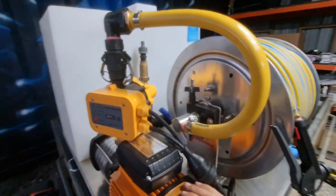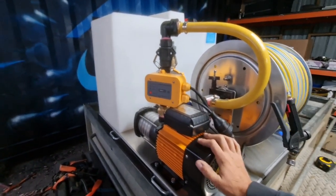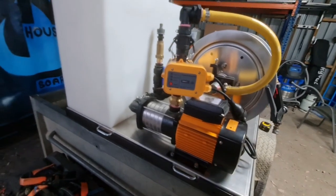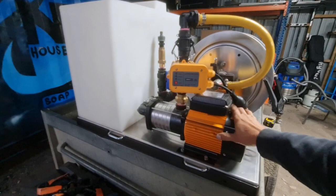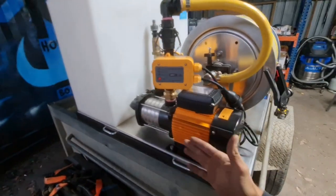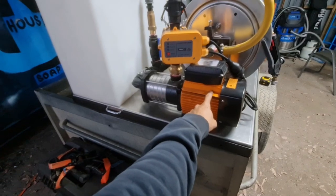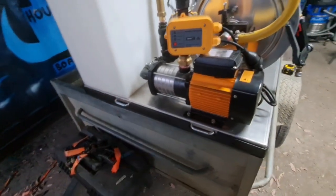Onto the replaceable items: we're using the 200 litre-a-minute 240 volt pump that we've been on for the last four or five years now. I love them, I can't fault them. Obviously we treat them as a disposable item. Talking to a few blokes using bleach pumps that are 12 volt, they're only getting three, four, five months out of them a lot of the time — some are getting more. Personally with these pumps we've never had one fail, but I would suggest to expect between 6 to 12 months of life. I've always just at around 6 or 8 months thought, if this stuff's up on a job it's going to cost me. At the end of the day it's a cheap pump — it's much better to just throw it in the bin and replace it with a new one, and then you're good for another 6 to 8 months.